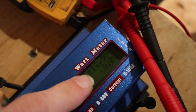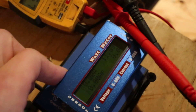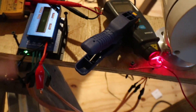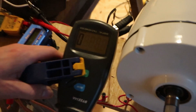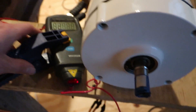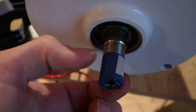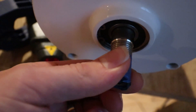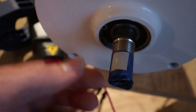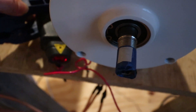I've also got my multimeter set up — it's a little redundant. This is showing 11.67 volts as opposed to 11.59 here; it's a little off, which could be because this is pulling a little bit of power. That was just a redundant check. I've also got my tachometer and clamp on. On the shaft of the turbine I taped it off because it was reflecting on the chrome, then put the reflective tape that came with the tachometer, so I'll be able to read the shaft speed.